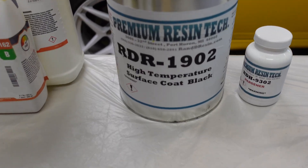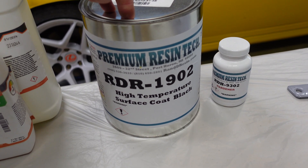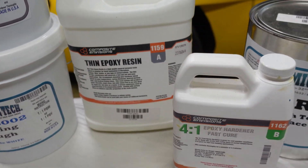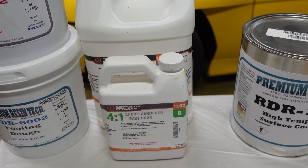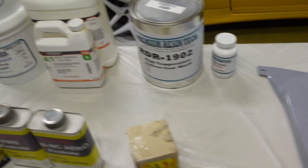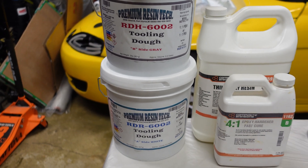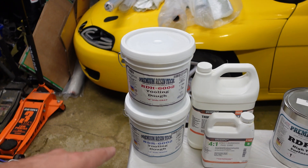After that I'll be using this, which will basically be like the gel coat or the first layer of the mold. Then for the fiberglass I'll be using the Composite Envisions thin epoxy resin — great for wetting out all sorts of fibers, carbon fiber, fiberglass, everything. I'll be using fiberglass and then for spots like the edges and more complex areas I'll be using this epoxy tooling dough, which is literally meant for making molds. It's like doughy epoxy — you'll see when I use it. It's very expensive though.